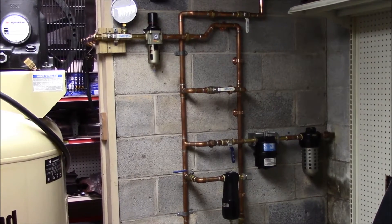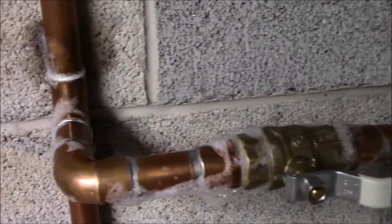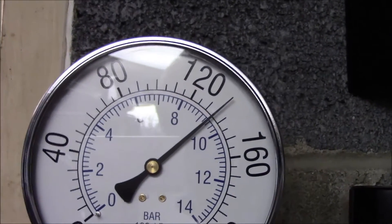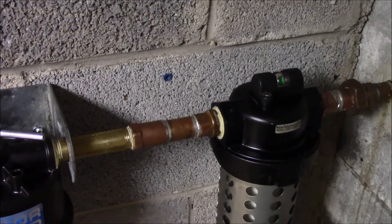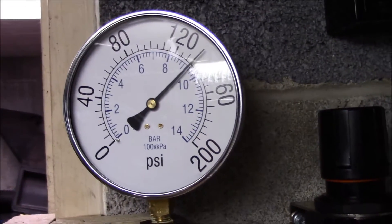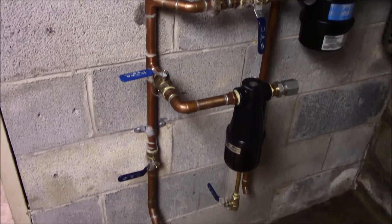I'm going to soap it up and watch it. I've got the soap bubbles on it and I'm going to continue to keep a close watch on it while I'm putting this IR back together. I bled a little bit of pressure off and I've got it sitting at 135 — that'll be a good indicator for us. I still haven't pressurized the little section going over to the garage, and I'm not going to do that just yet because I want to keep an eye on this gauge for a while first, in case something in the garage is leaking down.